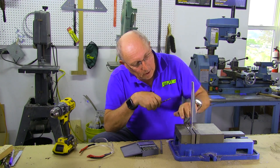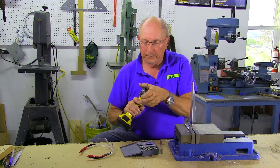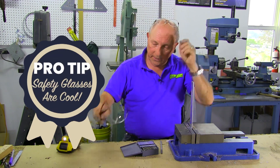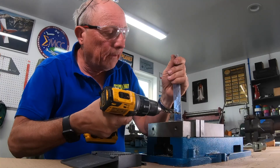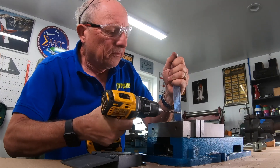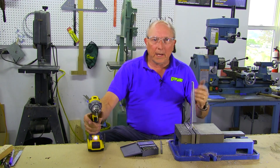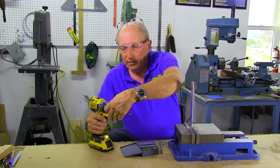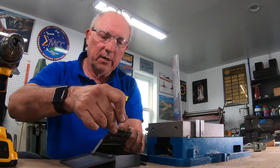For our demonstration here, we've already drilled a pilot hole, so we're going to start by up-drilling the hole to the number one drill. We'll put on our safety glasses for that. So that's an okay hole — it's a little less than a quarter inch and it's a little bit sloppy. So the drill bit goes away back into the kit and out comes the straight reamer.